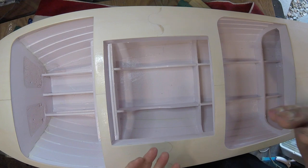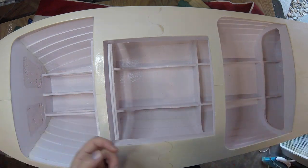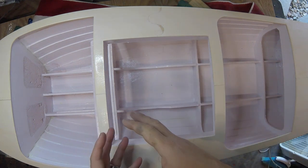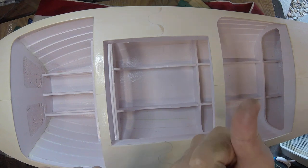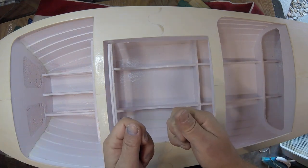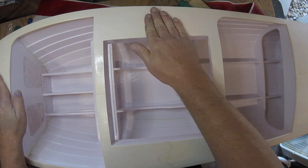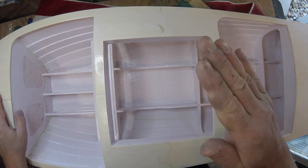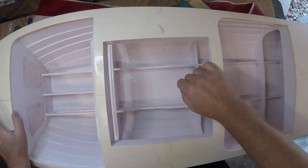The pros and cons to that — and I know this is going to be a long-winded video, it's all about talking. When you clear coat seal something, it works really well to seal the pores of the boat. This one is sealed and it goes on super smooth with very minimal rework as far as sanding goes. It's really nice for that. However, when you clear coat seal a boat, you get zero structural protection or strength.